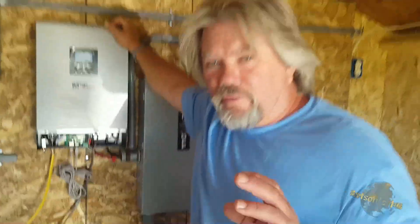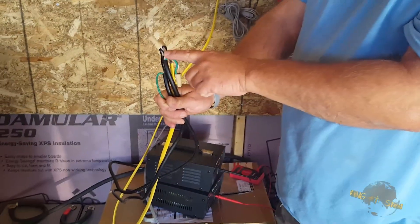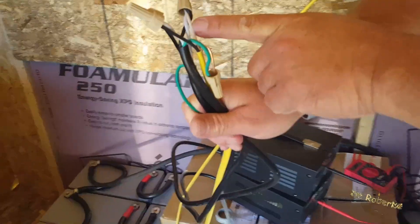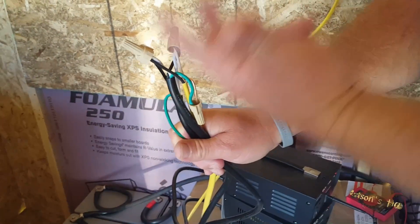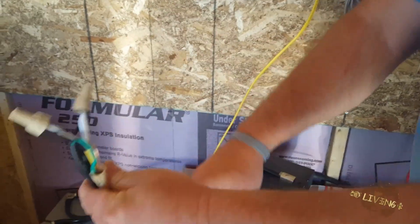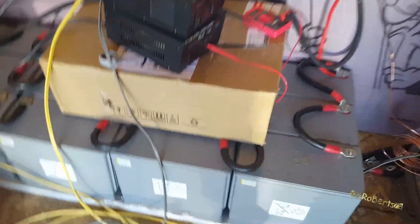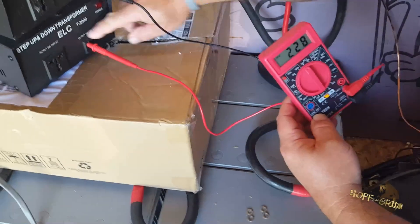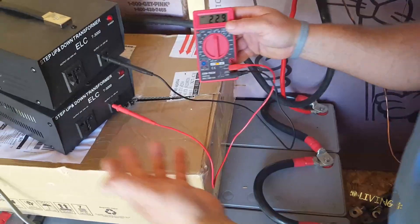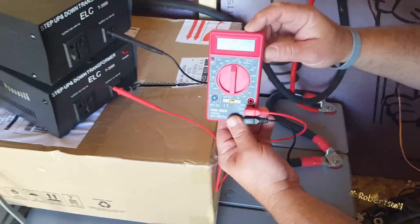What I've done is wired these so that the white wire of one transformer is wired in with the black wire of the other, and the black wire with the white wire of the other — the transformers are cross-wired on the input. This is 230 volts coming in here going into the inputs of these two transformers. Now looking over here, this would normally be the neutral side of an outlet, but this is just for demonstration purposes, showing that leg-to-leg we've got about 230 volts coming in.